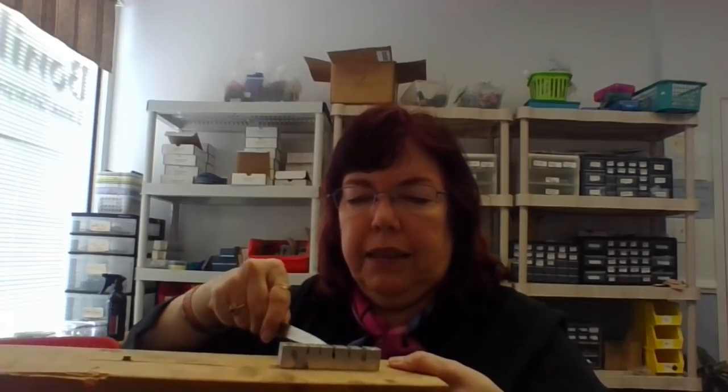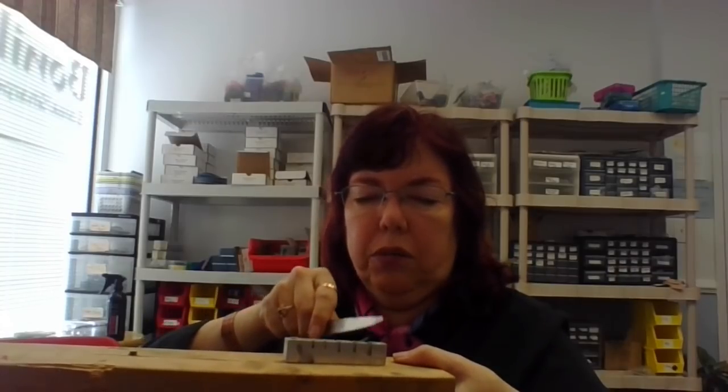I'm trying to, that slot's too small. And that's getting there. And you can kind of eyeball it when it looks like it's about right, and then go back and check it on your bar. And I hate doing this. If you're doing dog groomers, you almost have to. You almost have to be able to do this, because this is the only time I really see this kind of stuff is on dog grooming scissors.